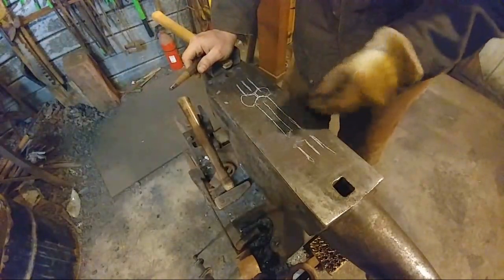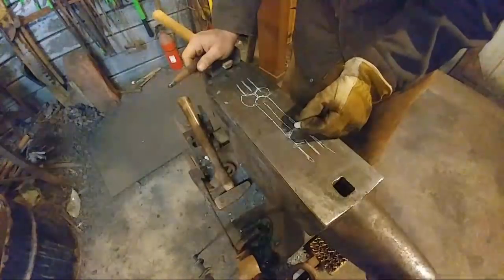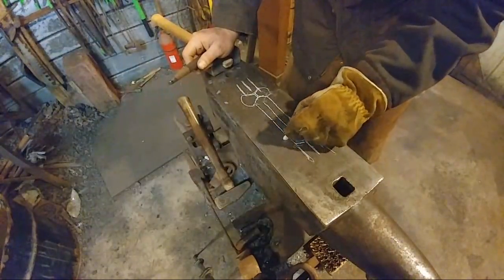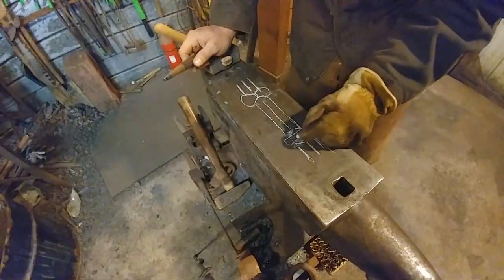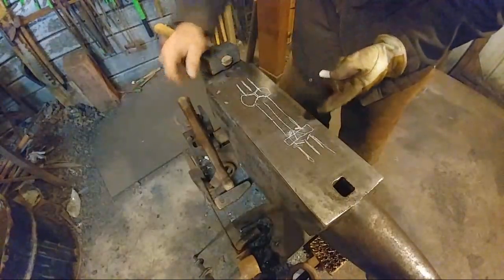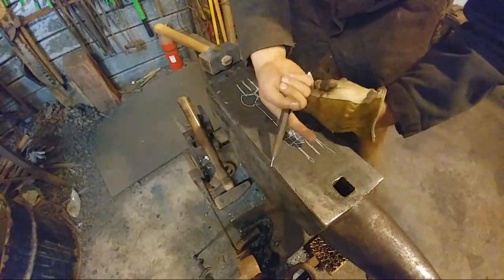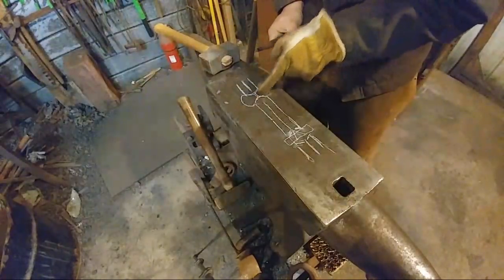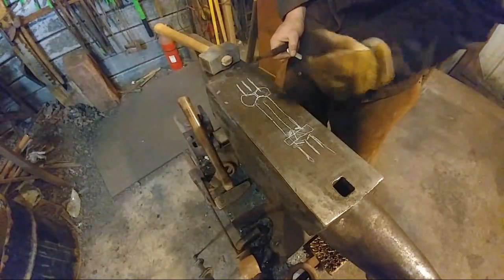All right. So if you do it the opposite way, what you're going to end up having is something that looks like this. There's a void. If you don't pay attention to it, there's a void in here. And when you stick a rivet down through here to be headed up, okay, it doesn't swell into this cavity, it just kinks over inside this cavity because it's got space to move, if that makes sense. So when you apply kinetic energy here, it bends the rivet. And when it bends the rivet, your two tong halves go like that, away from one another. Does that make sense to everybody? I think so. That's the reason why I said pay attention to which way you're punching from and make sure that you're drifting from the outside of the tong. They say yep. Okay, cool.